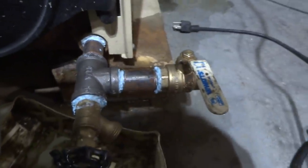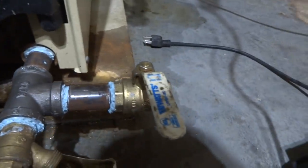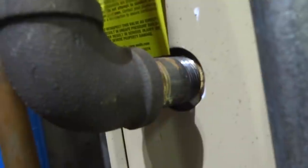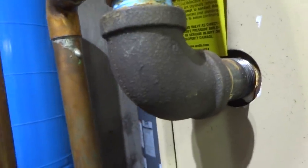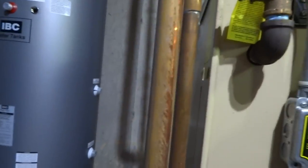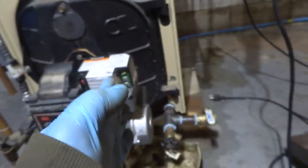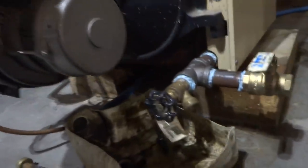Alright, so I just took that boiler drain out. It was leaking by anyway. We had a cap on it. I put a nipple, a 3/4 T, a new 3/4 boiler drain, and then I come out and put a ball valve. I'm going to take this out here and put a T here. And I could put the relief valve on coming out or going over that way. So one line's going to come out this way and over to them feeds, and this one's going to go around this boiler so this door can open for access to clean this boiler.